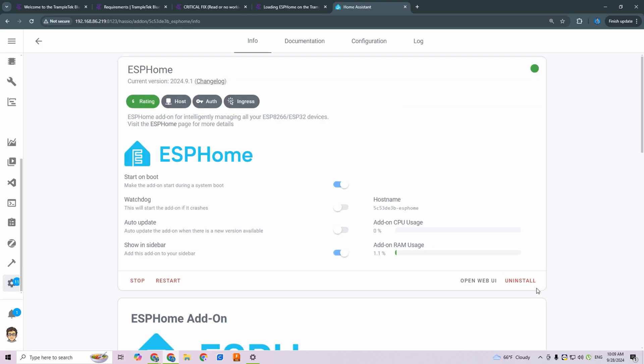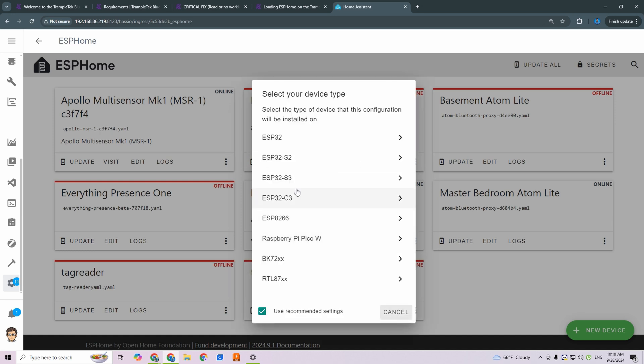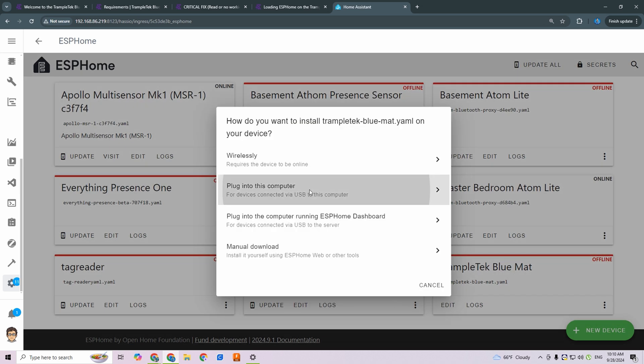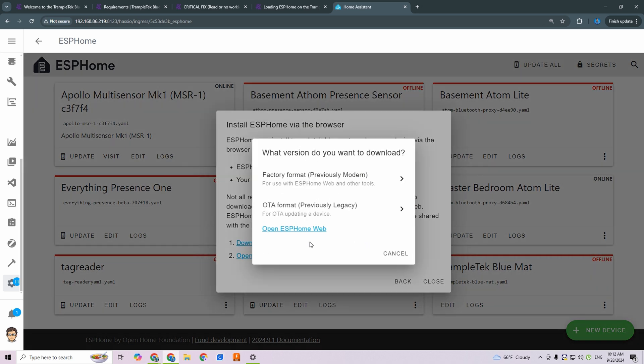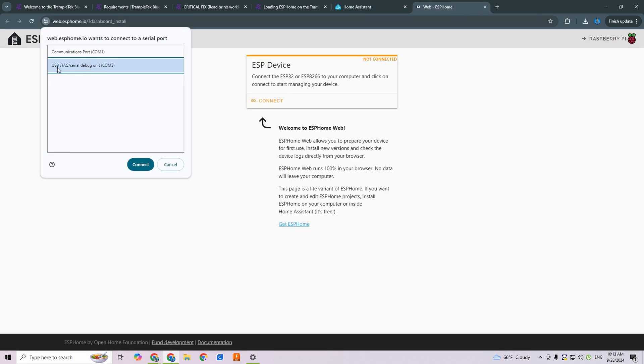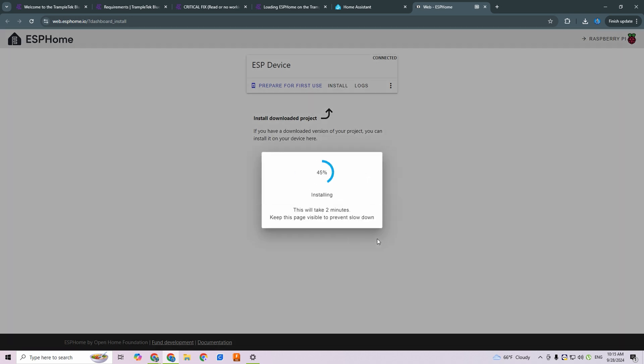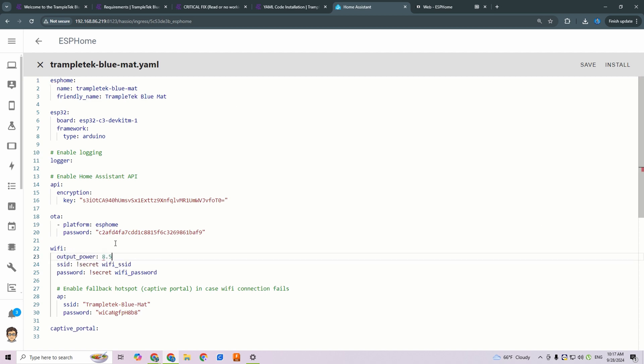We've moved over to my PC because I want to add this to Home Assistant. All we're going to do is put ESPHome onto this controller by plugging it into our PC and following some instructions they've created for us. We just go through the setup process step by step — configuring ESPHome, installing it on the controller while it's plugged into our PC, and then modifying the configuration YAML so that this thing works the way we want. It's very well documented, similar to how it used to be to set up the Everything Presence One when it first rolled out. Once you've got it set up in ESPHome it will be automatically discovered in Home Assistant.